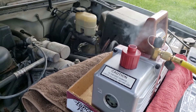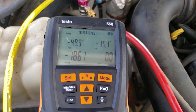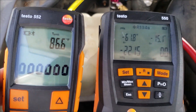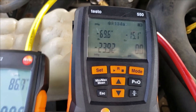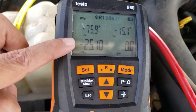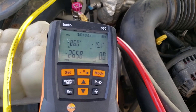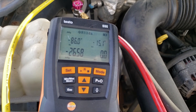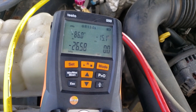We're blowing off a lot of vacuum oil and maybe some water vapor. The micron gauge is going to be reading 000 basically forever, so the manifold display is going to get me accurate readings. When it gets up close to 29.92 I'll be able to hook up the micron gauge. I want to come back in a few minutes, and if it's still at 26.58 then there's definitely a leak somewhere letting air in and not letting me get more of a vacuum.